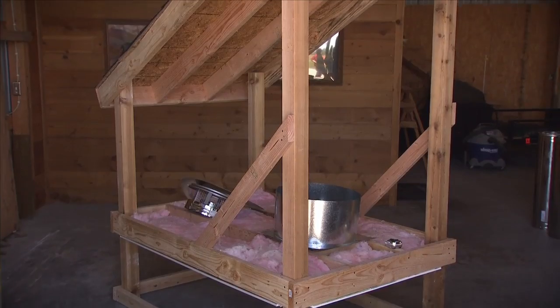Welcome back. We're ready to demo a through roof installation of a chimney pipe for a wood stove. Now, fire code requires that your chimney be at least 3 feet higher than the roof and 2 feet higher than any point on your roof within 10 feet. Placing your wood stove near the center of your home will help meet this requirement, and it'll help heat your home more efficiently. Our ceiling and roof mock-up approximates this.